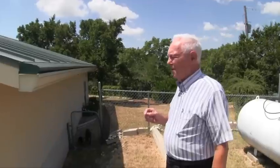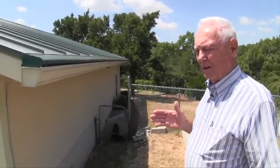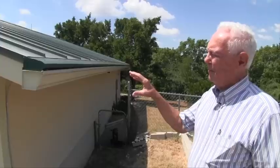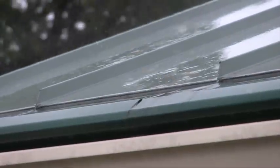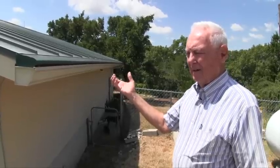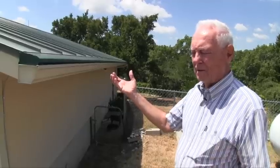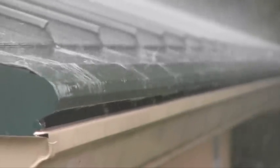The wells will go dry, but you'll be set up fine. One of the most important parts of a good rainwater system — in having that pristine water — is to get rid of organics. With this type of gutter, which is a leaf lock, similar to a leaf guard, it gets rid of the leaves, crickets, and other debris you don't want in your storage system. Because if it gets into the storage system, it degrades your water — you get yellow or brown water with smells. So this is one of the first important steps: get rid of the organics.